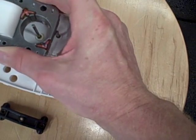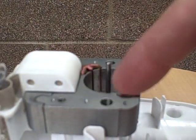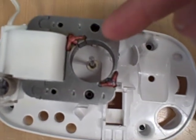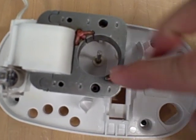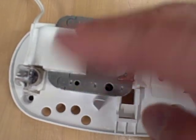The single-phase coil is enclosed in this white plastic casing, and the magnetic field from that coil flows through this pole assembly. These two poles alternate north and south, south and north, back and forth as the 60-cycle AC reverses polarity back and forth.